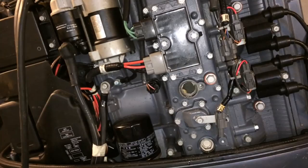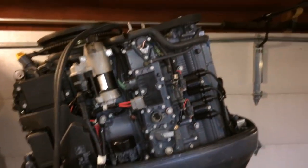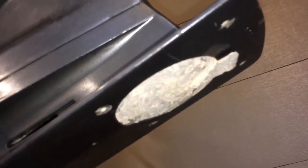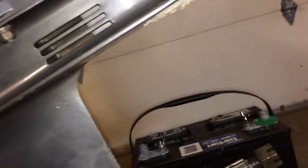Just some background on this motor — I got it three months ago and I haven't run it on my boat yet, it's just on a stand in my garage. But the previous owner said he kept it in the marina on his boat, so most of the zincs are pretty well gone. They're still serviceable, luckily. They still have some metal but not another season left in them.